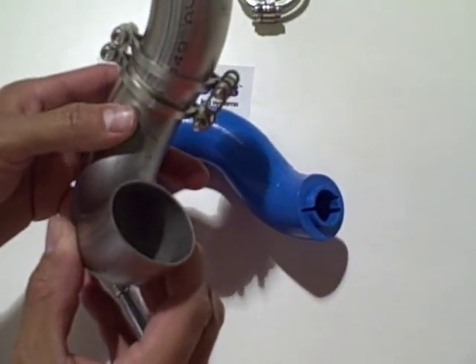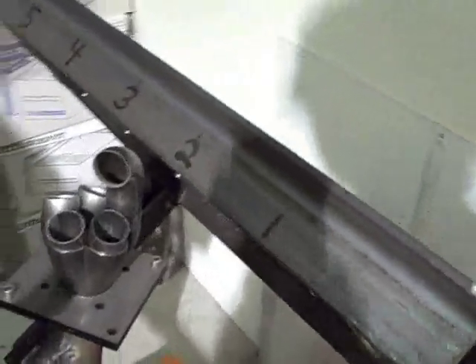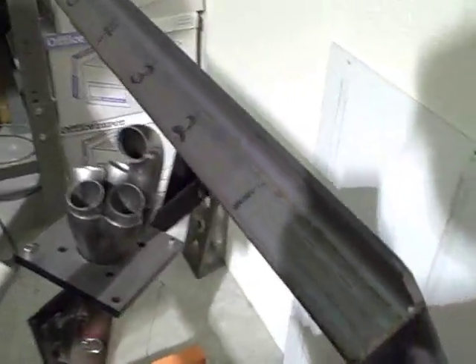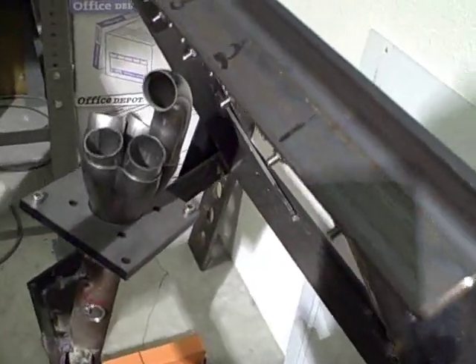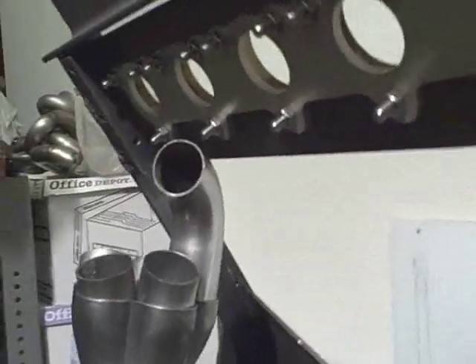And these are some of the features of the tack welding clamps. On a basic header assembly jig, we will show how the clamps are used. In this case, we are building a 5-cylinder header. We have a jig that holds the head flange and also a special collector with 4 initial runners. The 5th one, the one that is sticking out, is the one that we are going to build using the clamps.